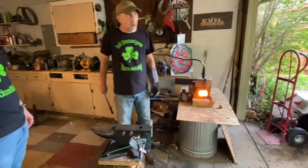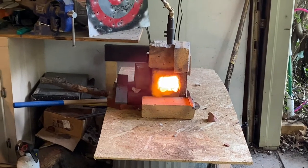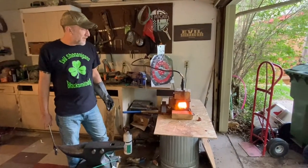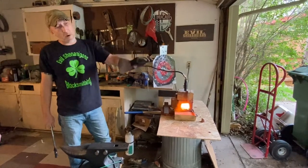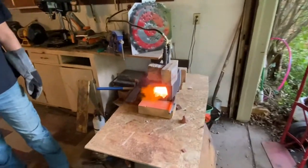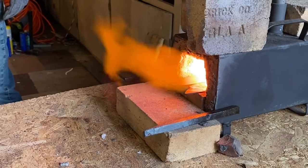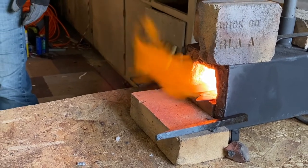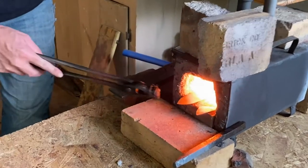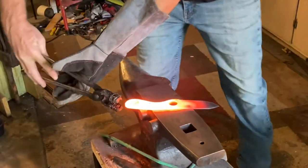To get set up for this point, we did the initial grinds on the belt sander and got the overall profile shaped. You want to leave the edge around the thickness of a dime before you do any of that stuff. If you go too much thinner than that, the edge will warp and look like bacon. You still got to have a little bit of meat on there. I'm going to flip this around and paint the heat up towards the tip.